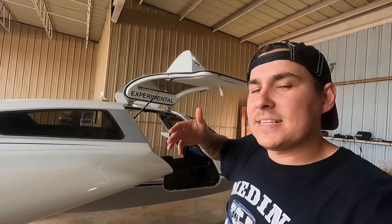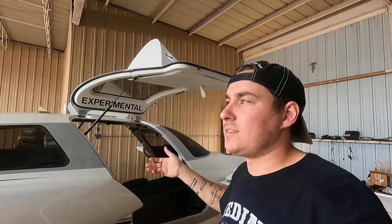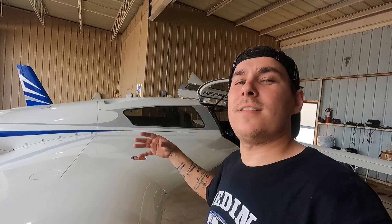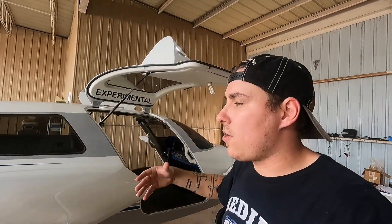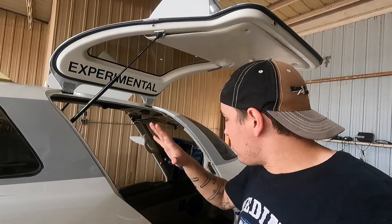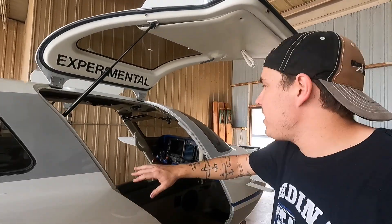With experimentals, they were built by some chaps in a garage somewhere. This one was built by God only knows who. That means they may have taken some creative liberty in how they built the aircraft and deviated from the drawings. Part of working on the airplane is a hunt to find the pieces, parts, and components you are looking for, and it can be quite difficult to track them down. Fortunately, when this thing went to the Velocity factory and was rewired and had the glass panel done, they did a really good job of labeling things.